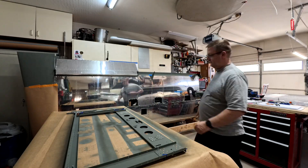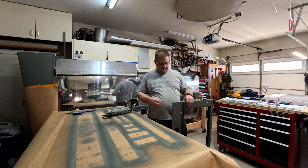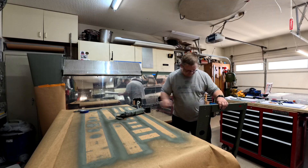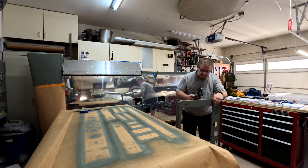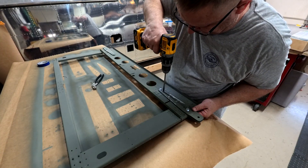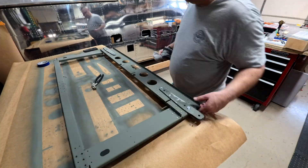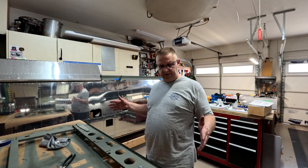There are a couple of things where I had to change the yoke I was using to make sure it could reach, but other than that it's pretty standard operating procedure. Most of the stuff so far in the fuselage has been the 470 rivets — not the countersunk rivets, but the ones with the shop head on them. They're easy to line up; you just put it on and it slides right in, then you squeeze it. That bracket is what holds the rear part of the wing on — I'm reaming it out right now using the 3/8 inch reamer.